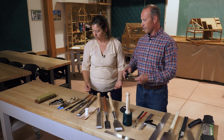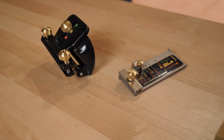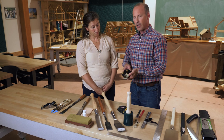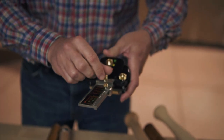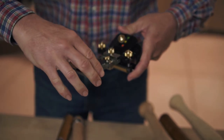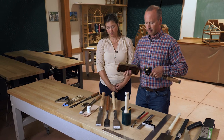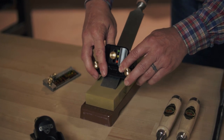In addition to all of those cutting tools, you need some way of sharpening them. In the vein of using hand tools, we like to use this guide — it's made by Veritas and it's called a honing guide. It basically locks your chisel into a device that maintains one consistent angle while you're sharpening the tool. What we like about the Veritas is that it comes with a jig that allows you to specifically set the included angle on your chisel. I've set this one up for 30 degrees. I can slide the chisel into the honing guide, lock it into place, and then remove this guide — you want to be careful sliding that off so you don't slice your thumb. The guide then holds the chisel at the correct angle as you slide back and forth on your cutting surface.